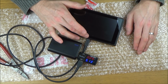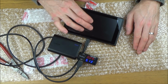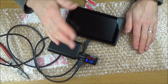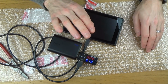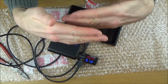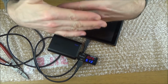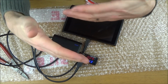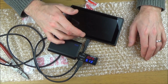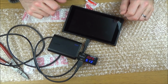I don't know whether those pads will go off on traces or tracks around the place, or whether it will be buried on the inside of the board, because on the boards in here, it's not just one layer like years ago where you had the components going through the board, and it's not just a layer on the top and the bottom. I believe there's many layers in between as well. So you have components on the top, components on the bottom, but then I think you have traces, tracks running in between the boards, like a sandwich of different layers, so it makes it very hard. So possibly the pads that are ripped off, I might not be able to get to them to repair. But I thought it would make an interesting video.